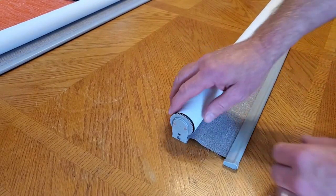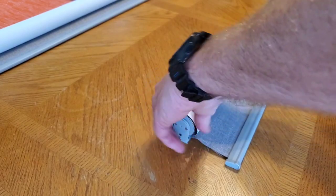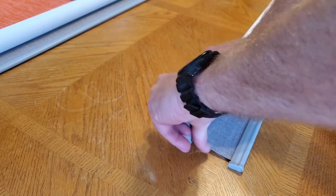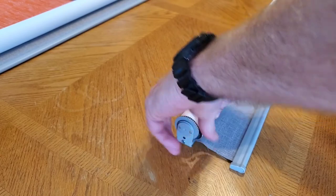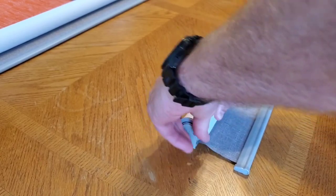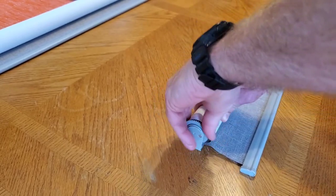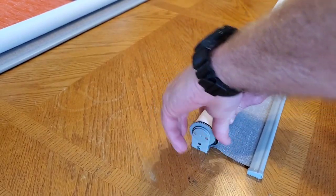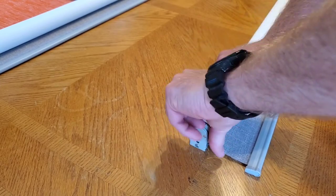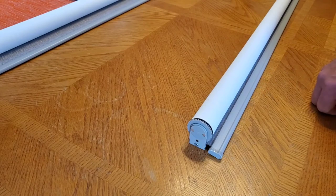So last you just have to rewind the spring tension. It's gonna take a lot. I think their website said 9 to 11 turns. You just keep going, put a bunch of tension on it, and then once you get it back up in your window on the camper, you can adjust it the rest of the way. And there you go.